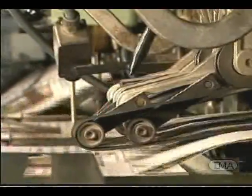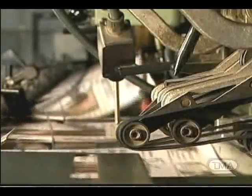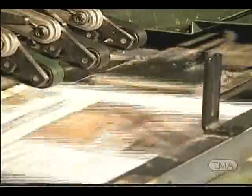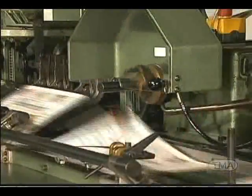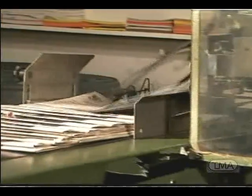The main section is fed onto the insert track using the same principles as other feeders. A timed pusher mechanism accelerates the main section to the speed of the carrier chain. The jacket then travels to the opening station where suction can be used to open the jacket, or the sword attachment can be used on heavy broadsheet main sections or thin products with laps. Positive control is maintained until the package is delivered onto a single belt and shingled to preset batches for fast and easy hand flying.